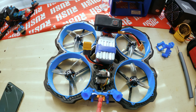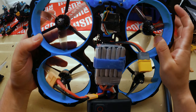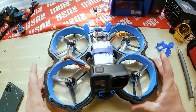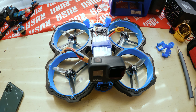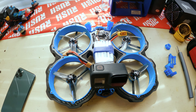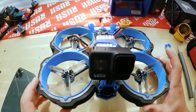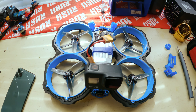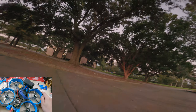Let's talk about the downside. It flies pretty good — that's an upside. Relatively easy to tune; it didn't take long at all. The motors don't get hot. I raised the PIDs and raised the filtering because it's a Cinewhoop — you don't want it to be super responsive. You can have more filtering, like put the gyro low-pass at 80 and dynamic. It's structurally very sound — I'll show you a lot of crashes I've had with this thing.